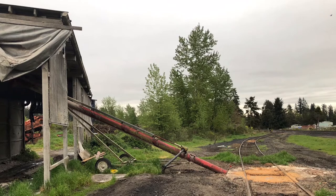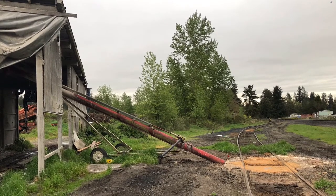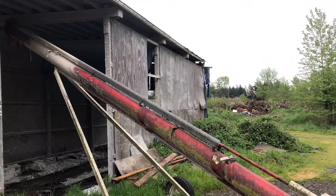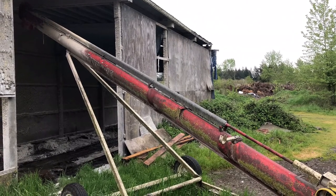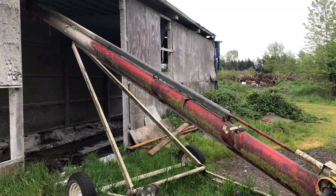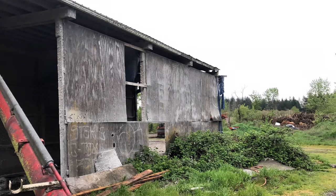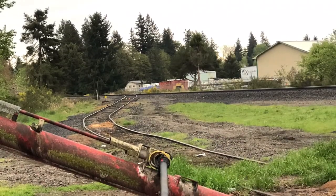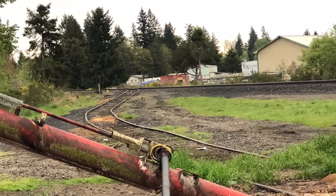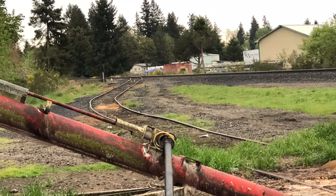A little bit later the same day — I abandoned the wood and started making this nice simple machine out of brass tubing. Literally, look at it — it's a frame, it's got a tube, it's got a couple of little wires on it. I took some detailed pictures so I could see a little more. I decided to use wire for the top rotary section, and once I got the wire frame done I could solder everything together because it's brass rather than use cyanoacrylate glue. So this is the start of building up the framework.